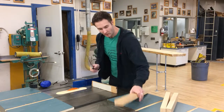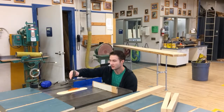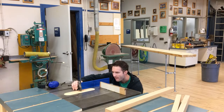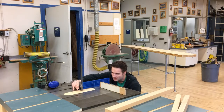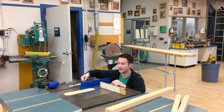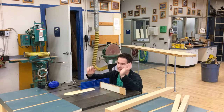I need to set my blade height. Knowing that my shoulder depth is a quarter inch, I want my blade at a quarter inch high. I can set the square here right at a quarter inch and just crank my blade down, making sure I'm looking at the highest point of the blade. By the way, when I'm doing this, the lockout switch on the front of the saw is off — the big heavy duty looking light switch is flicked off so that it can't accidentally turn on. Any time we're doing any sort of adjustment like this, that needs to happen. Our blade is now at a quarter inch high. Notice also I have a zero clearance insert — a very nice, crisp, clean insert which is going to give me a really nice scissor shearing cut, fully supporting the wood on either side of the blade.